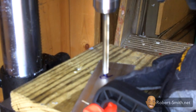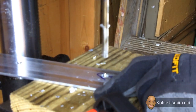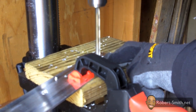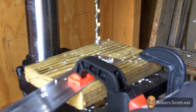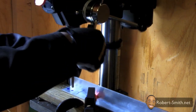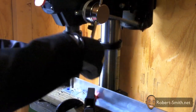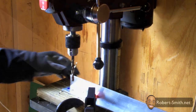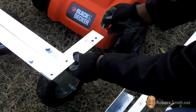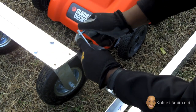Something to quickly note: as you're drilling your holes through your aluminum pieces, you definitely want to make sure everything is secured properly, or it can swing back at you as you just saw in the video. I'm now drilling out all the holes I marked — the spacer and the elongated angle piece. Once all holes are drilled, I'm screwing everything in place with hex bolts and stop nuts.